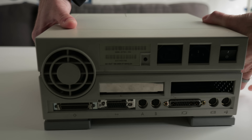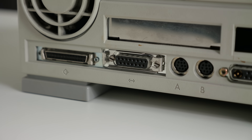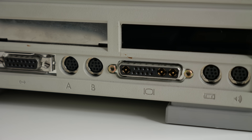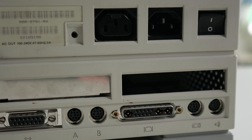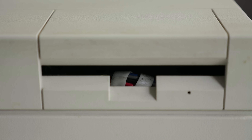This is strongly hinted at through the port selection on the back: SCSI, AUI, two Mini-DIN serial ports, 13W3 video, and custom interfaces for keyboard, mouse, and audio. There's also a pair of expansion slots we'll take a look at later, with one of the blanking covers having gone missing. What's also not here is a floppy drive, though I've got some ideas about dealing with that.